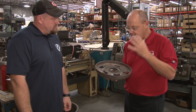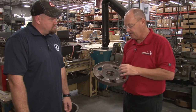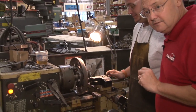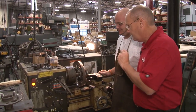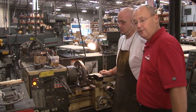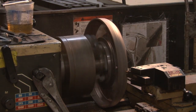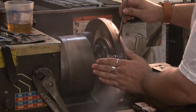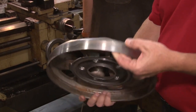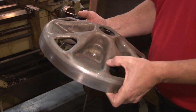After the hydraulic pressing, the wheels still need to get a donut welded in place, then sent out to have the lug holes put in, then they come back in for a machine operation. In an effort to make the most accurate wheel possible, they want to start with an almost perfect circle, so they take a surface cut on the perimeter of the insert prior to chrome plating. After the machine operation, this is the finish they get, and the wheel is ready for the next step: either lug hole stamping or chrome plating.